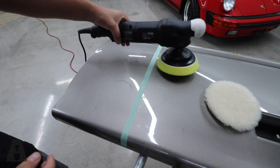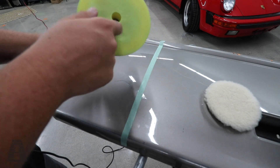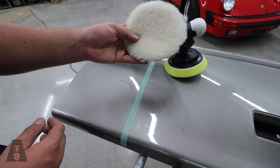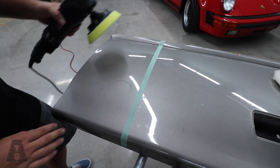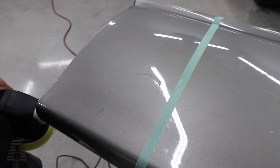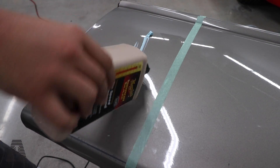So no reason to be nervous about a rotary. I'm going to be using a medium foam pad — this one is already primed with M100. Foam can heat up very quickly. You want to be a little bit more careful if you're going to use something like a wool pad. The area we're going to be burning is right here because it has this kind of flaw already, and as we get closer I will talk to you about what to look for.